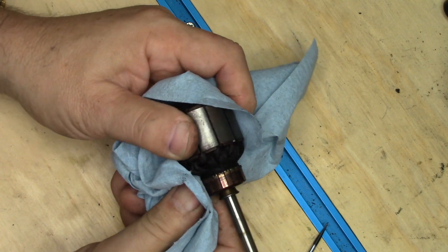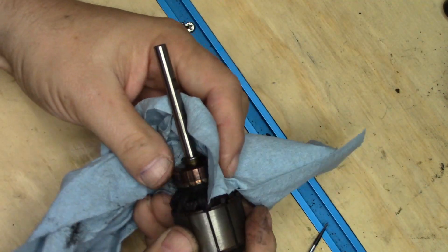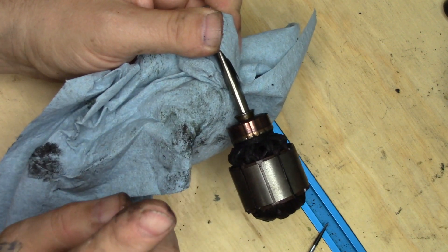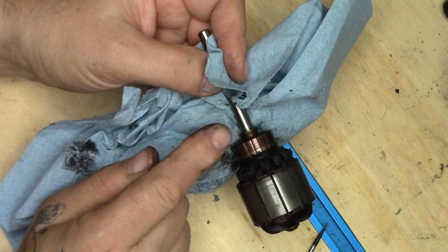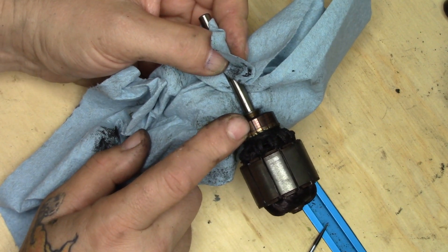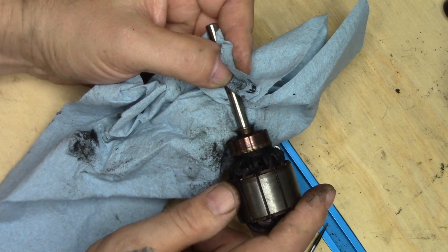What I'm going to do before I rewire is take this commutator — the whole rotor rotating mass assembly — and take it to the buffer to polish these commutator bars. Actually, I'm going to do this a little differently: I'm going to chuck this into the Jacobs chuck of my bench motor — my charming wife's bench motor — and polish these in another method.